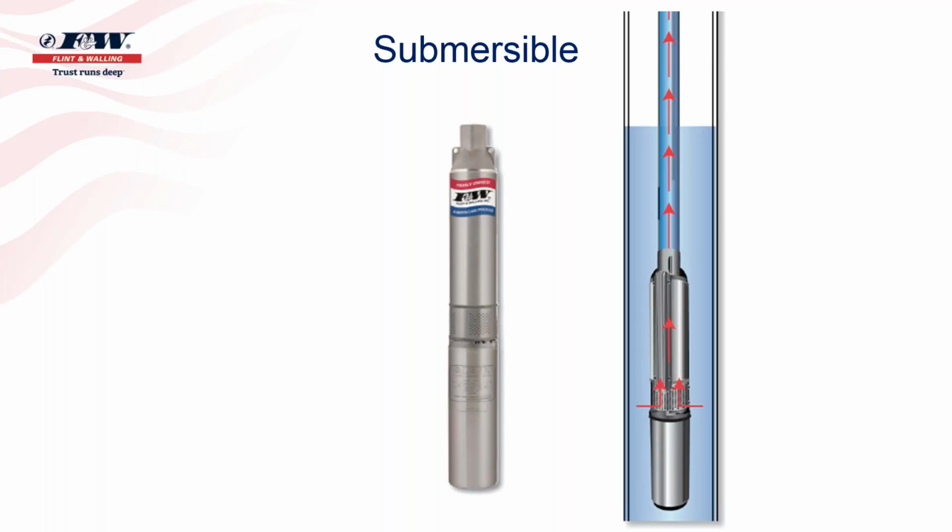And so one advantage that a submersible pump has over an above ground pump is this. An above ground pump has to really do two things. It has to lift the water before it can begin to pump the water, where you do not have that equation going on with a submersible pump. It simply has to push the water out. There is no lift. It's always submerged in water.